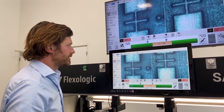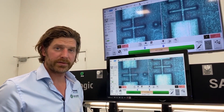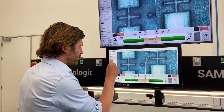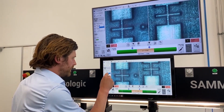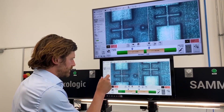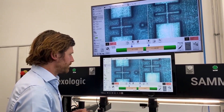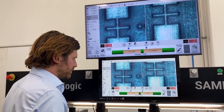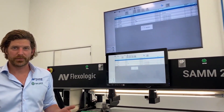I need to fill in the right repeat size — this is in millimeters, but the machine can also be set to work with inches. For how many plates, I want to do two plates today on this job and I want to stagger the plates. You can also set the plate distance between them. It says four colors but I want to do eight colors, so we say 'create job and mount' — and the job is created.